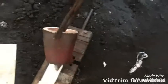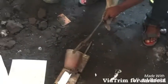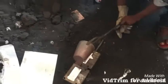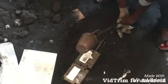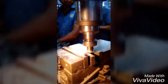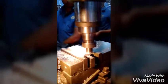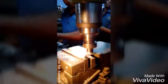After the square groove is made through electrical discharge machining, a specially designed non-consumable threaded tool is rotated and plunged into the selected area. The downward force of the tool maintains pressure and creates friction heat between the tool and workpiece.